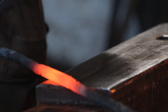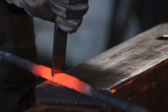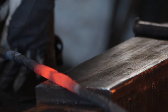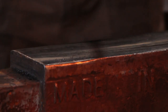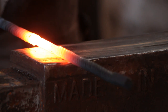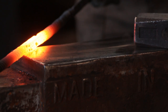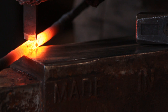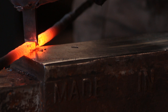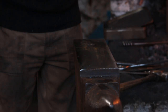At this stage, head back to the anvil. At the mark between the two two-inch marks, chisel down about halfway through — I went a little bit far on this one. Then for the second part, turn it 180 degrees and chisel halfway through as well. That will ensure that you are able to fold both of the end twists on opposite sides of the central twist. If you do both chisel marks on the same side, they'll just head-butt each other.